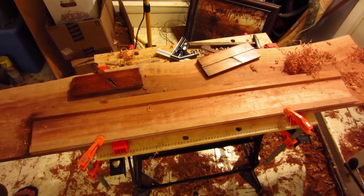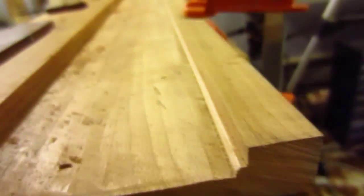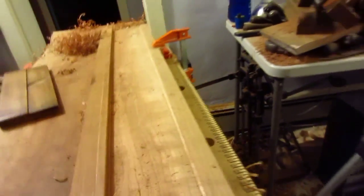Let me take the camera down and give you an idea of what we're talking about. That was probably about a dozen passes. You can see that little tiny bead there now. Not bad — it's pretty easy using a plane like that. I took that edge from pretty squared off to a nice round edge. As with all planes, your starting edge is generally a little rough. I can use a paring chisel to clean that over, but once the plane was fully engaged you get a nice round little bead all the way down. Only a couple minutes' work.